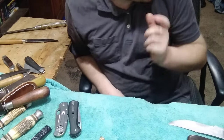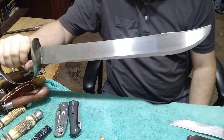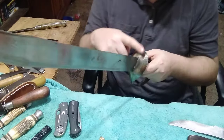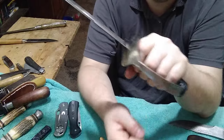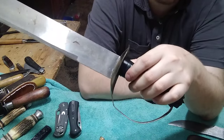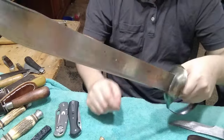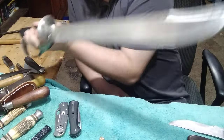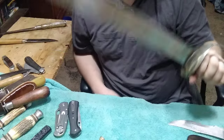Next - it's been a while since I made one of these. I made a small pirate's cutlass out of a machete I bought. I kept the original machete look - it has a distal taper going all the way out to the tip, giving it a pirate's cutlass look. I took one of those large spoons and turned it into a guard, and filled the whole handle with liquid metal, permanently locking it in place and adding good weight. It is somewhat flexible but that's really good for a cutlass. I put a better edge on it - it's perfect. May not be the prettiest but pirates didn't take care of their swords. I'm gonna keep it, but if someone makes the right offer I'll probably sell it.